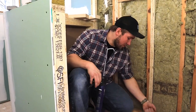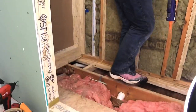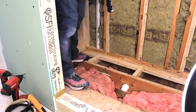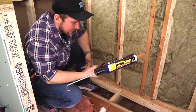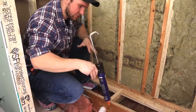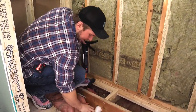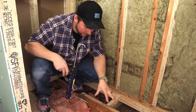This is how you basically get it all patched up — this is strong. We've got one, two, three blocks, and we also threw in some blocks the other way. Now we're going to get our deck glue, subfloor glue, put a whole bunch of it down here, and screw it down.